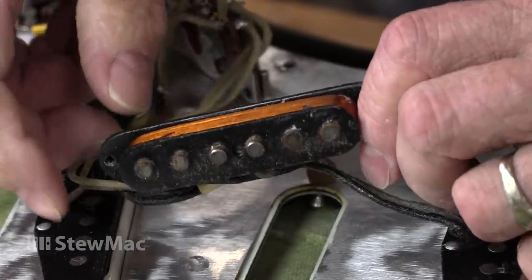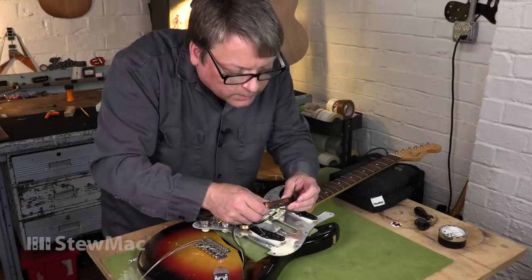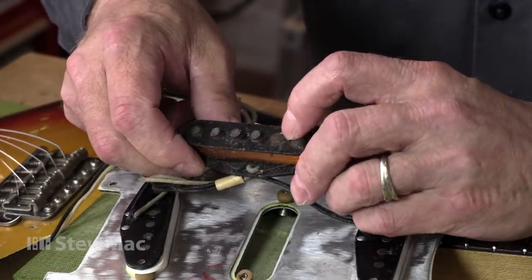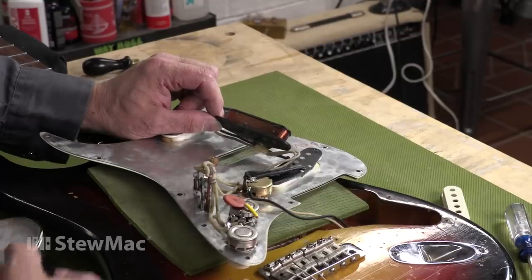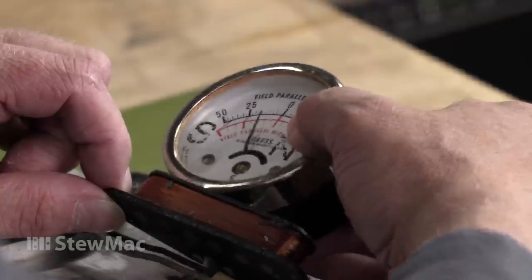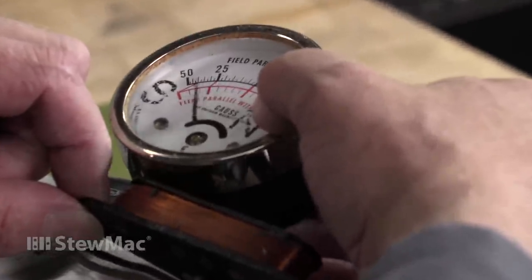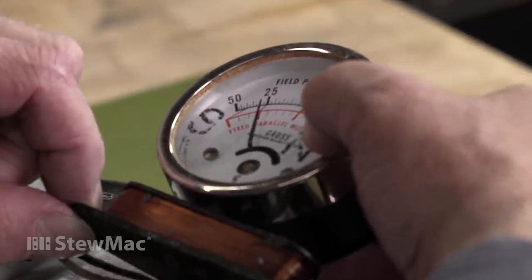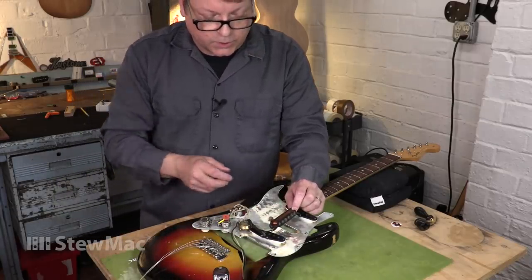I can scrape it off with my fingernail and melt it in my fingers. There's no real signs of any damage here, just a little bit of corrosion and crud around the B and E pole pieces. I'm going to check the gauss to see how the pickup is charged, because sometimes there might just be a weak magnet that needs to be recharged. They're reading right in the range where they need to — 25 south up. So it's definitely not the magnets, it's definitely not the charge.